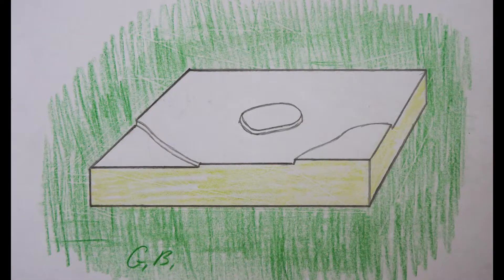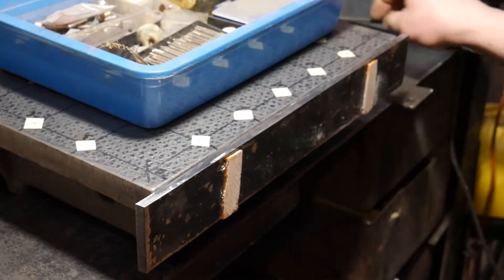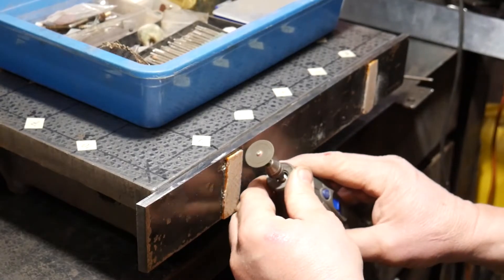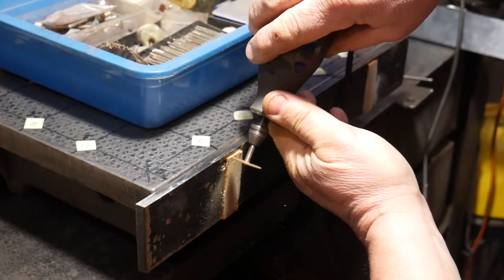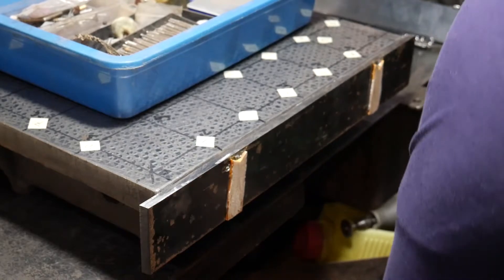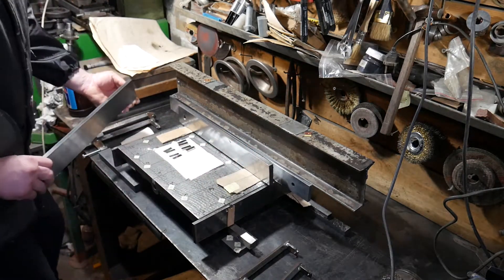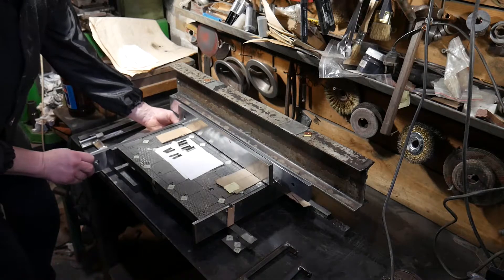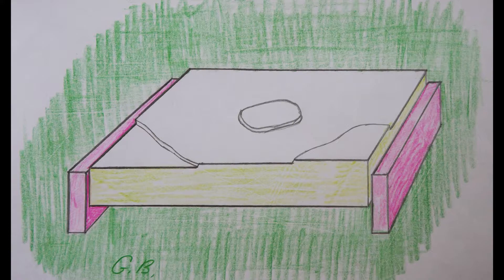The surface of the surface plate has deviation from the ideal plane. This is how this method works. I make places for gluing the side straight edge. The straight edge must be glued absolutely precisely. I made illustrations — after looking at them you can understand what technology is used for precise gluing of side straight edges.